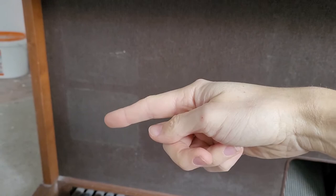Speaker-wise, we have a huge 15-inch bass speaker. This one that looks tiny compared to it is a 10-inch, broad range, basically all the other frequencies. And on the left, this is more important, those two squares, there's an actually rotating Leslie speaker in there, a speaker and a rotating drum, made by the real Leslie company. So this is one of those main key features that really makes the organ interesting and stand above the competition, basically.